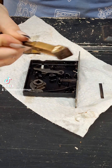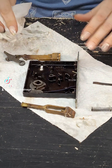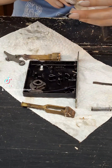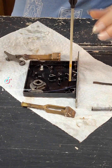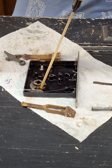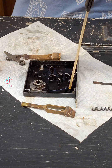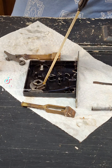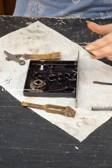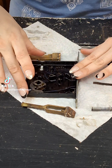Some parts are covered in paint — we're going to take care of that. I've gone ahead with just a paper towel and damped the inside dry. We're also going to go in with a little bit of rust remover. I'm just dabbing a little bit of PB Blaster — you can use WD-40, some people like graphite. I prefer this to keep everything working smoothly and prevent any rust buildup. This one's fairly clean; yours may not be. You may want to go in with a brass brush to loosen up the rust and wipe it out.